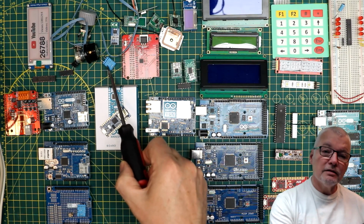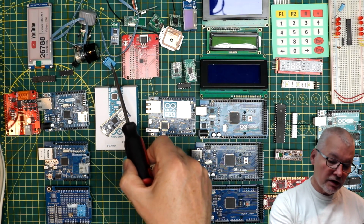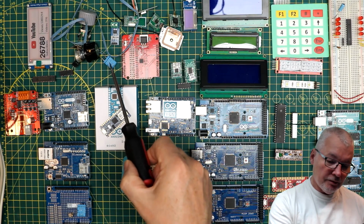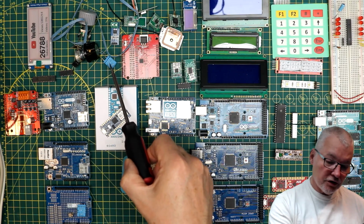We've got a DHT11 temperature sensor. The 22 is just wider range and more accurate than this one, which you can just use 1 wire plus power to measure temperature, humidity. We'll do a video on that in the future as well.